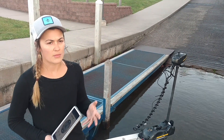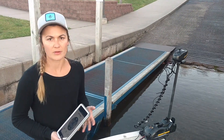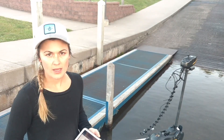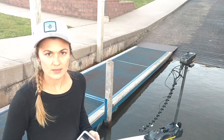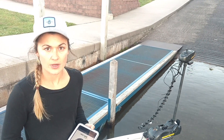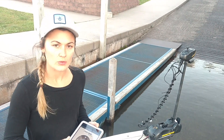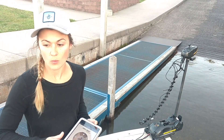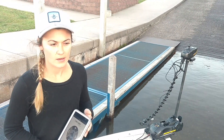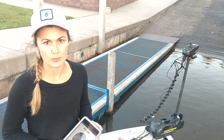And fourth, if you've had unexpected performance from the ProNav Angler, go ahead and recalibrate it. You want to calibrate your ProNav Angler when the boat is level — you can do this while your boat is on the trailer in the parking lot, or in the marina on the dock when the water is nice and calm. Just make sure it's not near a large magnetic force like a large iron break wall.